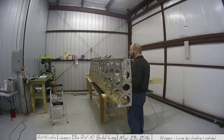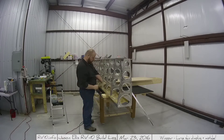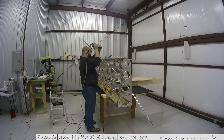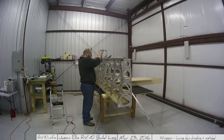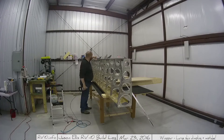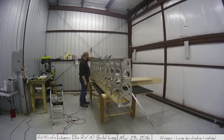I'm really glad I caught it. This is one of those things that could have bit me. I think had I managed to rivet the skins on without riveting those things first, I could have still saved it because I still had access to the backside — but it was much, much easier to rivet it all on using the squeezer, as you're watching me do here. I sped this up considerably because it took a long time. There are quite a few rivets — every single rib has four or five, plus all of the doubler plates on the back. It was quite an effort and took several hours to get all those riveted on.